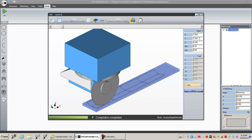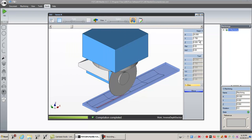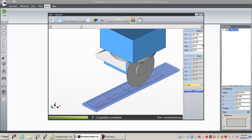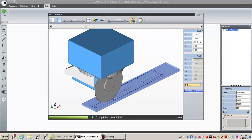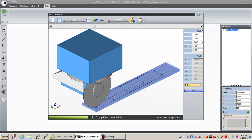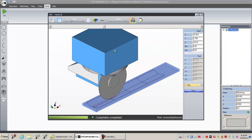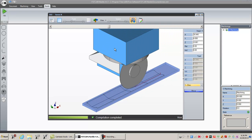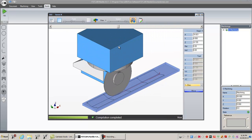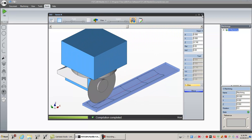Alright, so we're at Y1. See, there's a 1/4 inch. That was our step, right? 1 1/2, 1 3/4, 2. See, the z-axis is starting to go down now. See that? 0.3. Alright, so you get the idea. This is going to go back and forth, and then the z-axis, when it gets more than 50%, the z-axis will start raising. Okay?